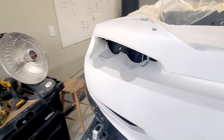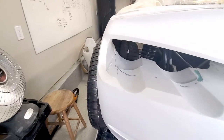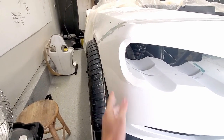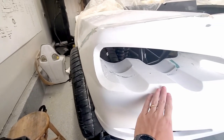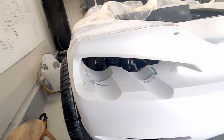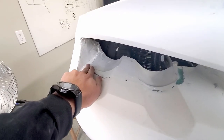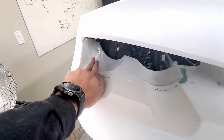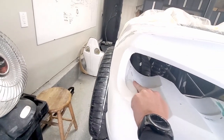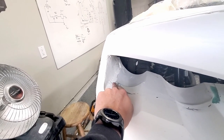All right, this is after another application and sanding of the joint compound, drywall stuff. And again, the outside here looks just great. I mean, it's matched just perfectly. I really like how this is matching the bevel and coming up around, so it's matching both bevels. I think that looks really sharp. I'm really liking it. And here you can see I've still got some things to work out. It's just a lot harder to apply and sand. So the outside was much easier to get quicker than the inside. So I need to do that probably one more time on the inside.